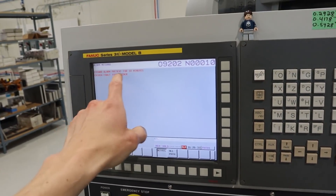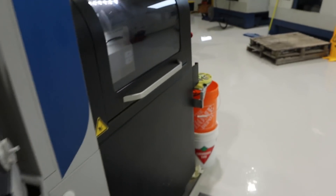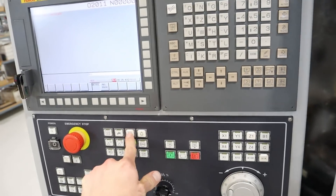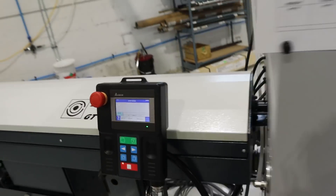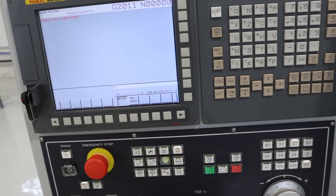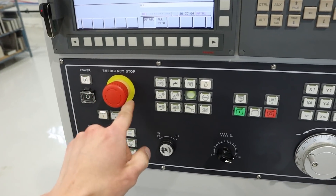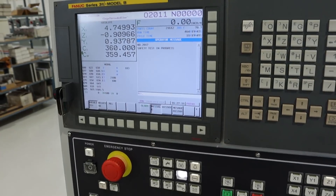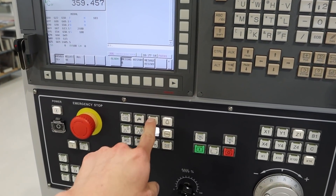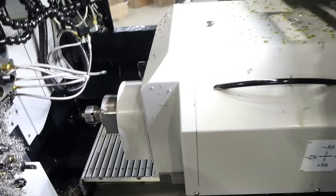What's the alarm telling us? Fault tube feeders. I'm pretty sure we're out of bars — yes, we're out of bars, so that's the alarm. Let's open the door. Bar stock empty. You've got to clear that error before you can clear this error. There we go — now I can open the door. No, I've got to turn it on, and then do a safety check. Then I can open the door.